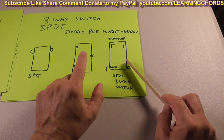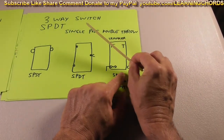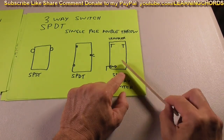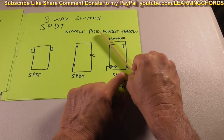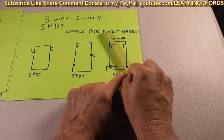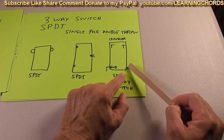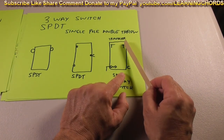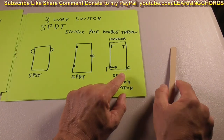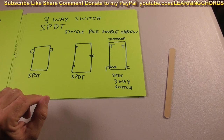So this is the common, just like this, single pole, double throw. We're connecting the common to this side. When the switch goes in the other direction, we're connecting the common to this side. That way or that way. This is called the common. These are called the travelers. I can't even remember, one of them is called the leg, and I don't remember what the other thing is, but it really doesn't matter to understand what's going on here.